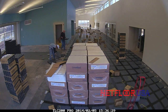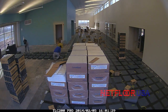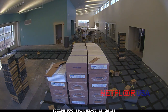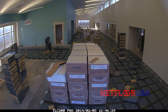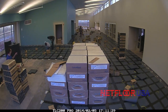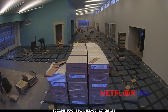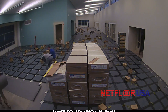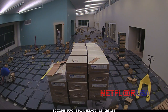As mentioned, this is a public library. One of the key goals when they designed this building was to really engage the community. In today's information age, that means you have to have a lot of electronics, tablets, and access points for the internet, otherwise the library is going to be unused. This means you're going to have a lot of electrical and data wire requirements, and you have to have an effective way to manage all those cables. Instead of concrete trenching, core drilling, or running cables overhead, a cable management access floor is a cost-effective and easy solution to manage all of your cables.